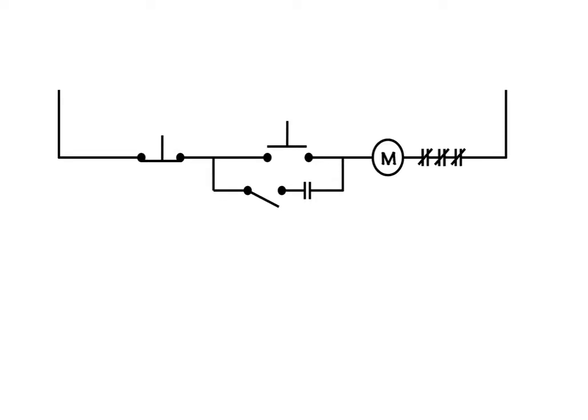What we have here is a circuit that looks very much like a standard push-button three-wire circuit. We have our normally closed stop button, our normally open start button, our M-coil or motor starter coil, our three overloads denoting that it's a three-phase system, and then we have our contacts — our holding contacts, sealing contacts, or auxiliary contacts — that are attached to this M-coil.